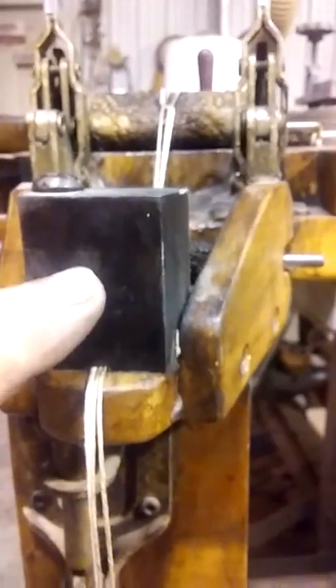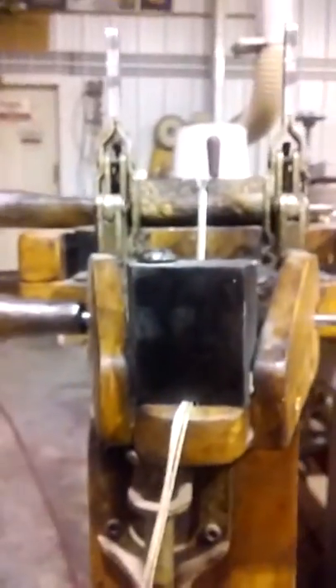I've got one hand so I can't straighten it out for you, but you can see how the three come through here nice and straight. It comes through a die that I cut — this is also UHMW plastic — and it's on the toggle bolt clamp and it flips up. You would think that glue or wheat paste would get in here and screw it all up, but it doesn't stick to that plastic at all. The way this works is you just tilt it this direction and pull, and it will cam and lock up on that string.